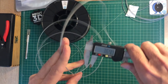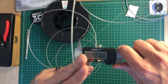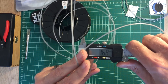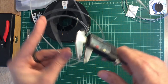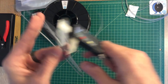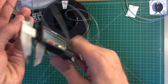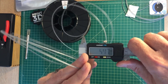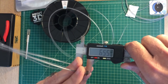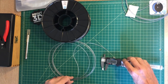Our first reading gives us 1.75 — always a good sign right off the bat. Our next reading gives us about 1.76. The filament diameter tolerance is between 0.005 and 0.05 millimeters. This one is 1.68, which is a little bit lower than the standard tolerance advertised. Then we have a 1.76, a 1.74, and a 1.70 — staying within the 0.05 millimeter tolerance. And a final reading of 1.75. So that's a pretty consistent filament diameter.